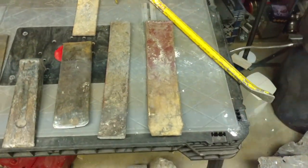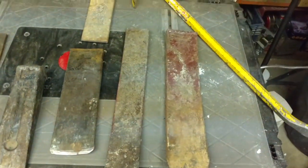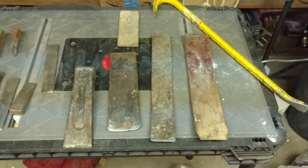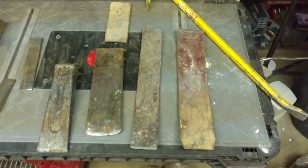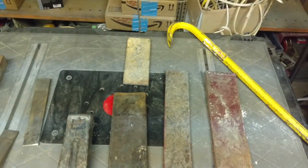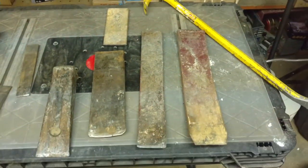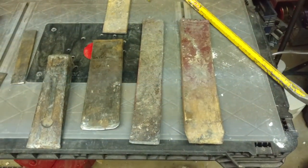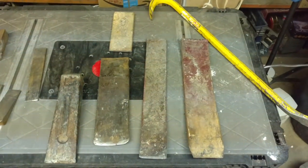Over on this side are a bunch of old leaf springs from cars that have been cut down to various shapes and lengths. I personally find these two long ones to be a little too long — they get too much bounce when I hit them with a hammer, so I don't use them and I'm considering cutting them in half. It's really good quality steel if you don't overheat it when cutting and shaping the tip. They are very, very hard to break, but also very hard to cut and grind. Don't turn it blue — don't get it too hot when you grind it, because it'll weaken the steel and make it brittle.